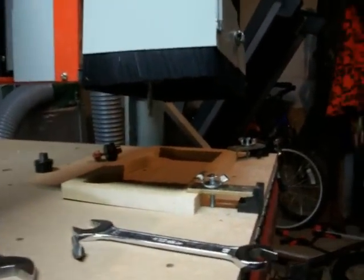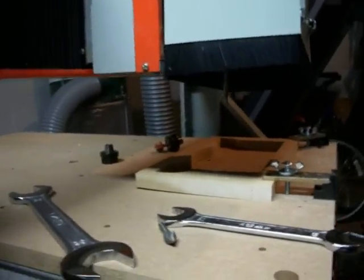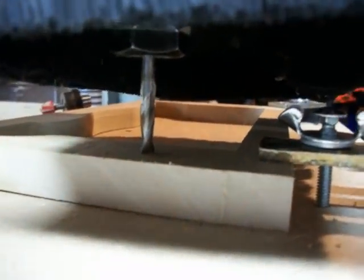I come back over here. I type in Z0, look back up here, and hit enter. If I'm wrong it's going to smash into the material, but if I'm right it's going to stop at the very surface of it. You can see that it lowered down and it's right directly on the material. And that's how the tool change works on the FTC.